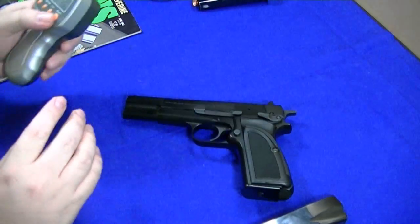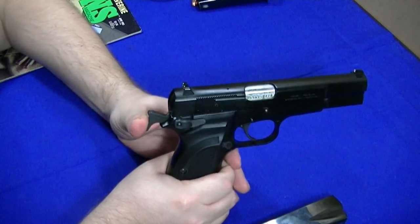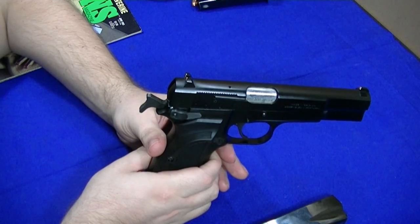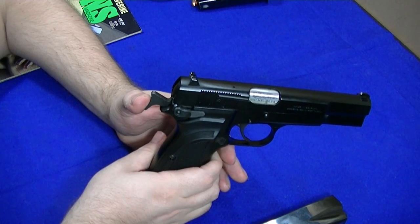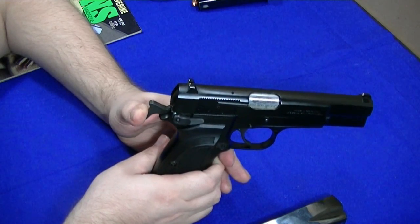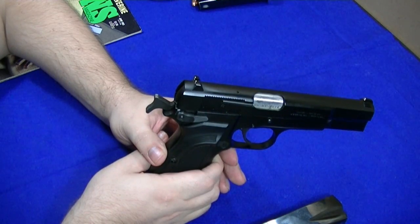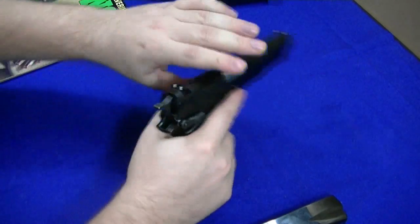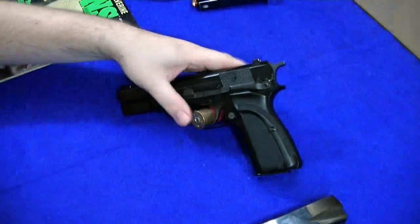And while the magazine disconnect is to blame, the hammer spring on this is also extremely heavy. I mean, you're not going to get a light primer strike on this thing. I think it's rated at like 32 pounds, the mainspring or hammer spring. Now, I think they used to come with like a 26 pound, and that's probably really what they need. But maybe that keeps from battering the guns up, or maybe they use the 32 pound on the .40 Smith & Wesson also, and feel like being cheapskates and not changing them out or something. I don't know, but it's heavy. That's one of the things that really makes you work for it when you're trying to shoot it.